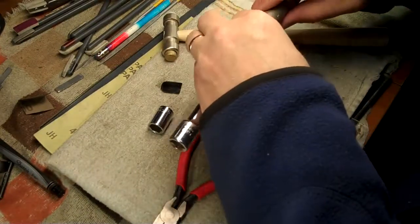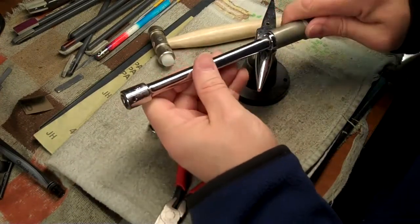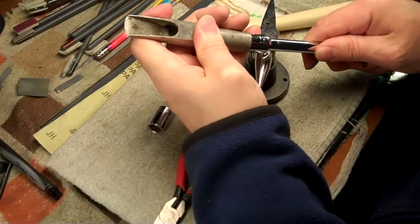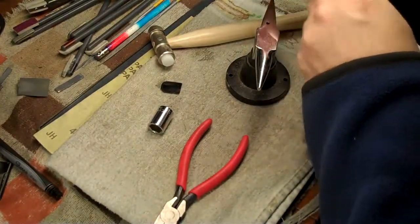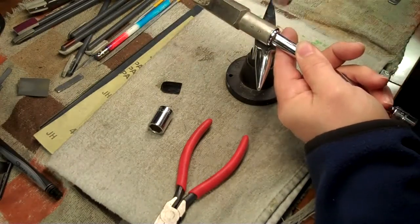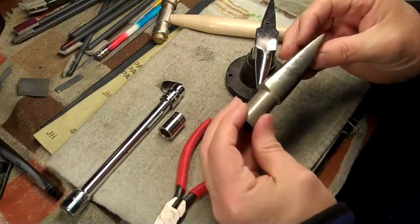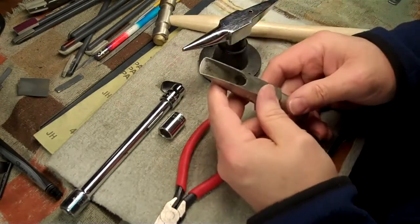But if you're working on some brass, you may have to give it a little bit of persuasion with the soft end of your mallet. So I got a little better, but the other end won't go though, so it's not perfect. You sometimes might have to mark high spots with a marker, but you know, there's a high spot right there that I see. So there's no need to throw these things away — they're repairable. And then I can get a nice facing on there.